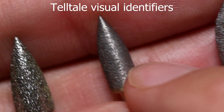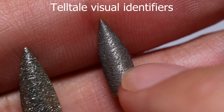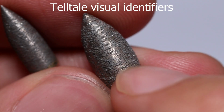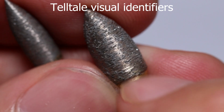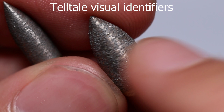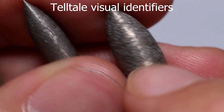Whereas here in the sintered diamond case, all you're going to do is peel off outer layers until eventually you'll wear it down to nothing. The only thing that can happen is that with some of the bigger, coarser grits, you can knock those little diamonds out and then you're just left with little holes. In that case, that's when you use the dressing stick, because the burr starts cutting too slowly, and with the dressing stick you grind off a lot of the metal and reveal the fresh diamonds underneath.